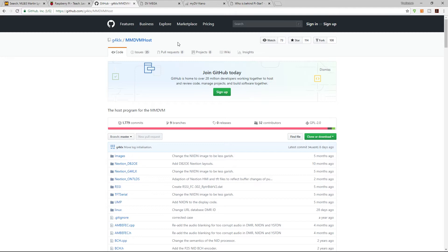There's a little bit of a learning curve to get the Nextion screen working. Essentially, you copy a file to an SD card, plug the SD card in, and follow a procedure when powering it up. This process writes the config file to the TFT screen itself, and from that point on it handles display functions. It's been programmed for MMDVM host.